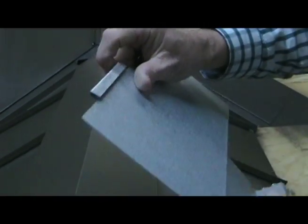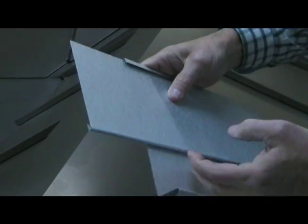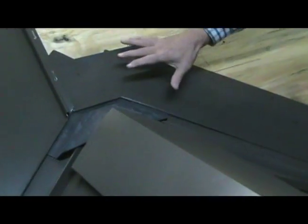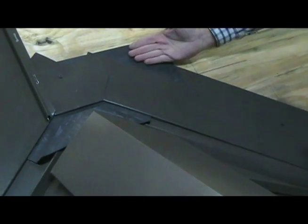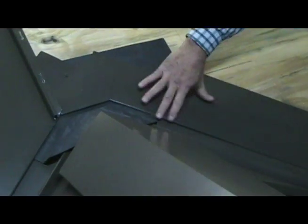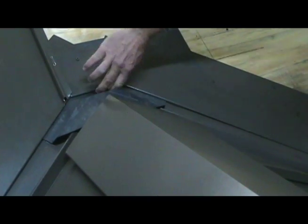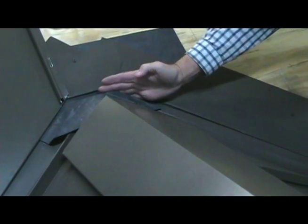Other times, and with the Valley Cap, we use a free clip. The clip fastens through, and then you pull this up and the panel locks onto the clip. The reason, as you can see the clip installed here, using a Valley Cap, we need to use this separate clip because you can't get the cleat over the top of the Valley Cap, but you can run this clip right up over the top of the Valley Cap. And then when the panel comes in and hooks over these clips, you've got a complete watershed from panel, Valley Cap, into the W-Valley.